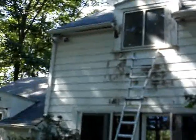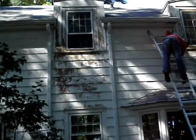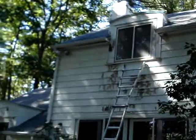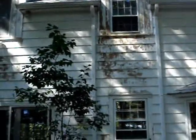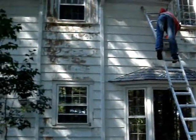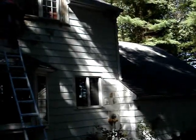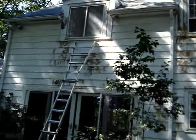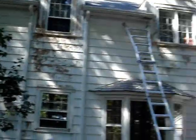Because if today you were to tell me I want the whole house painted, I could completely change the way I'm doing things, and instead of doing piecemeal spots here and there, I would plastic off these windows after I finish sanding everything, and I would prime the hell out of just about everything. In fact, if you wanted to go the full Monty, we would oil prime the bare wood, then spray prime the whole house, back brushing it all in, and then spray on the paint. And you'd have a perfectly painted, very nice looking property. Of course, you would still have to deal with all the rot. So maybe that's not the best avenue to go down.